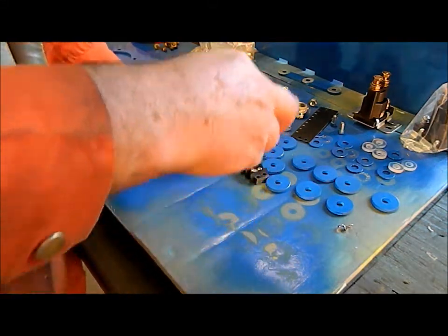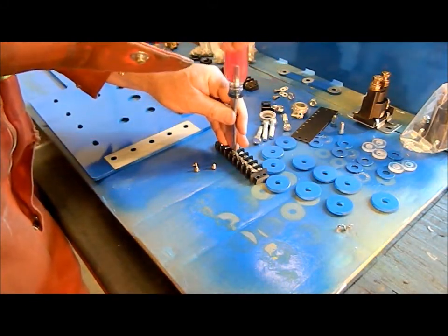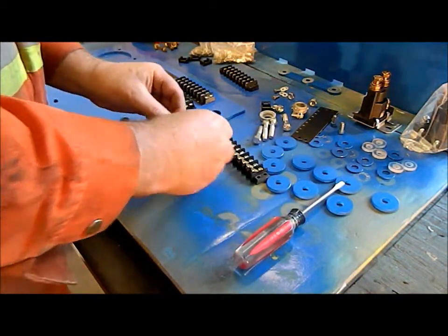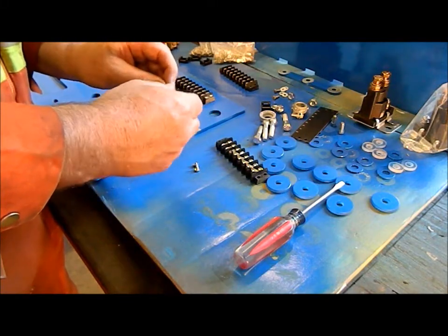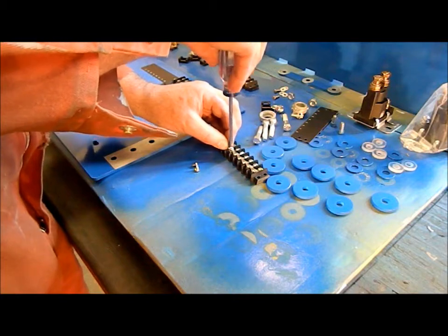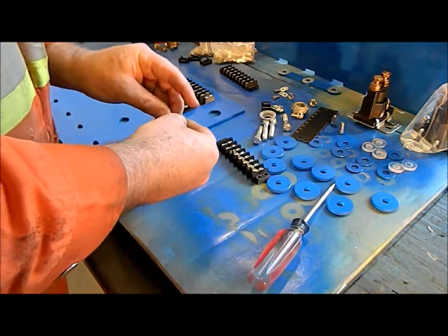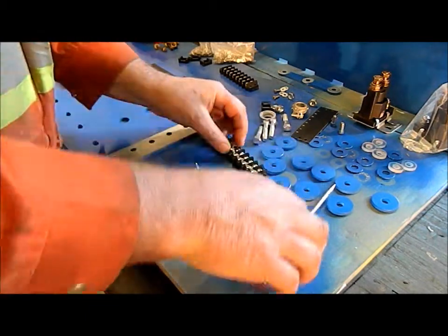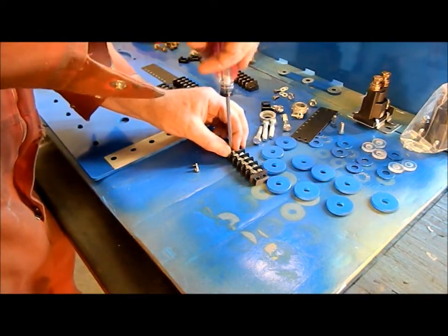On the machine itself, the original factory wiring was 18 gauge. Well, it's hard to tell. It could be 18 or it could be 20 gauge. It's larger than 22. Which is too bad because 22 gauge is quite common in multi-conductor cable for signal, but 18 gauge is not quite as common, hence why it was much more expensive. So we're going to try and reuse the multi-conductor cable.